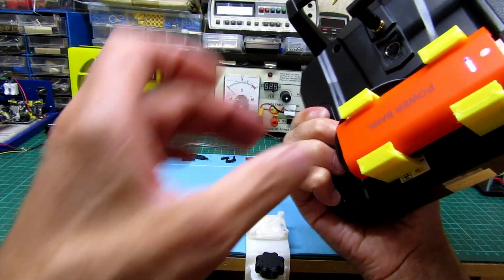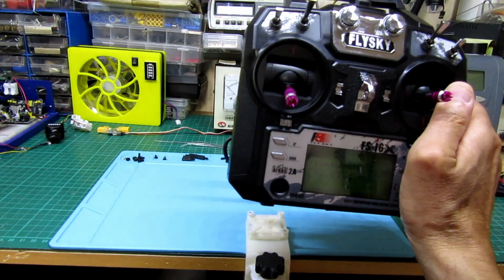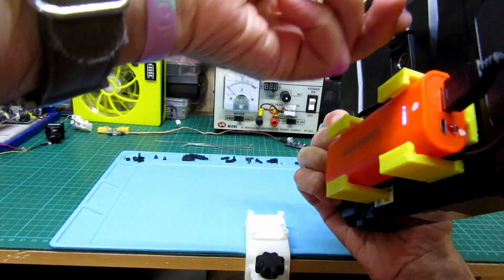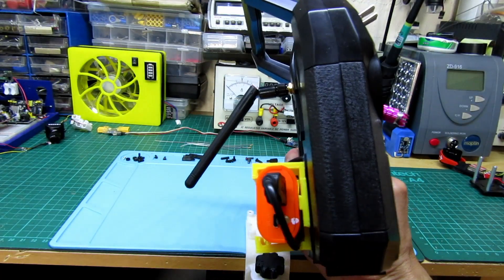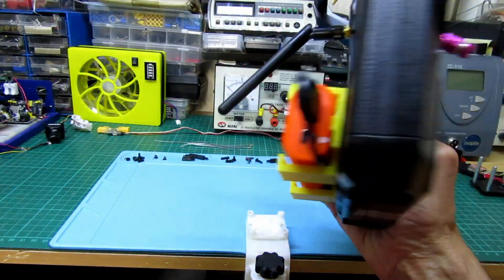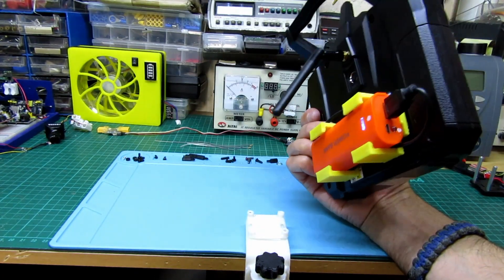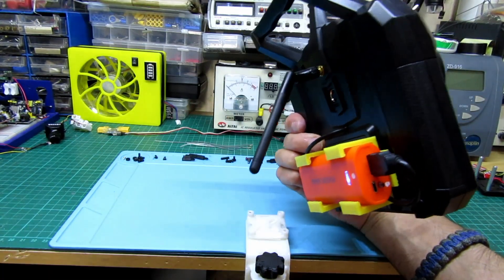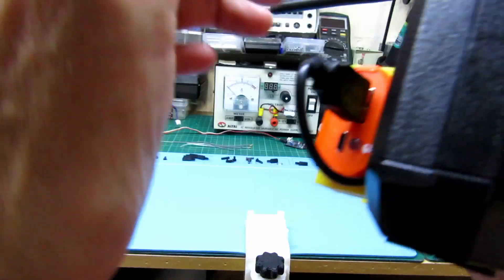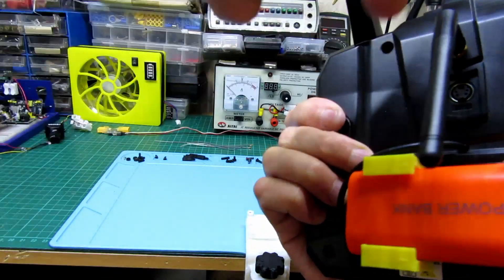The antenna mod should give us a little bit extra. I've got this antenna coming along this way. I'll probably have it down, so when I'm flying like this — that's probably the best position. You could have it that way depending on how you're flying. I'll have it so it's roughly 90 degrees to the other one to get a nice RF pattern.